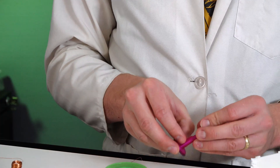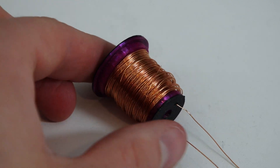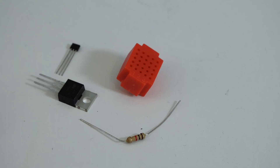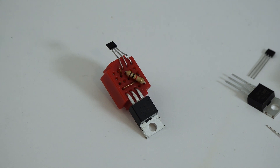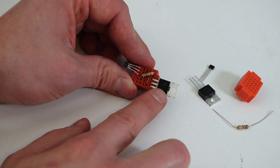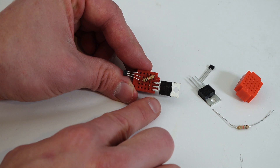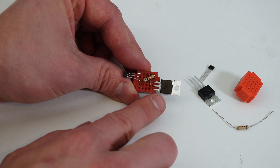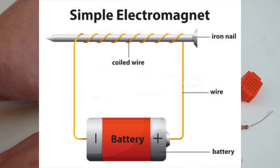We'll cut to a fast forward here and I'm just going to quickly create an electromagnet. The next step is to put everything together — now we have our mini breadboard with our two different kinds of switches and a bunch of other different electrical components. Essentially, what's going to be going on here is this switch is going to turn on our electromagnet. However, if this detects a magnetic field, it's going to send a signal to this one which will turn off the electromagnet. But as soon as the magnetic field is gone, it's going to turn it back on. So hopefully it's going to create a back-and-forth effect that will lock a magnet in place right below this sensor.